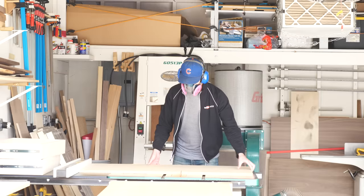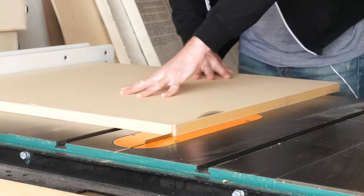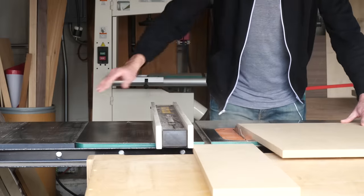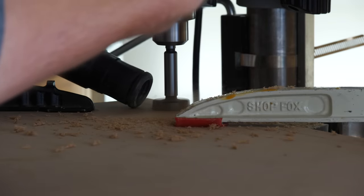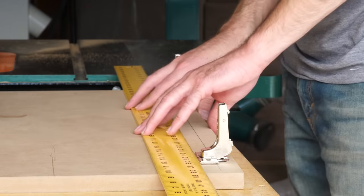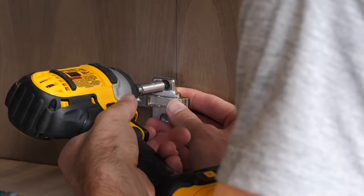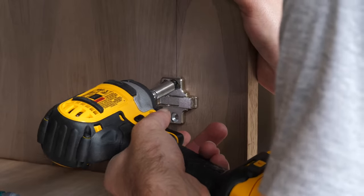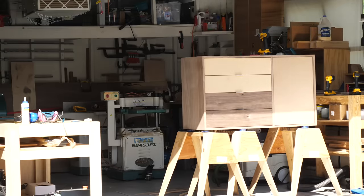The next day on my way home from work, I stopped by and picked up a couple of two-by-four-foot pieces of MDF and some paint. I'm going to use these for the top two drawer faces and the door. After I'd cut the three of those pieces to their finished dimensions, I mounted the drawer faces the same way I did the hardwood ones, then used my drill press to mortise out some cups for the hinge hardware. Once those were installed, I attached their accompanying clips to the inside of the cabinet. The door and drawer faces are inset from the exterior pieces by about three-quarters of an inch but flush with the vertical partition — there's just a little extra measuring to account for.